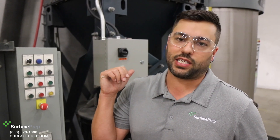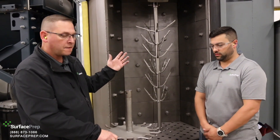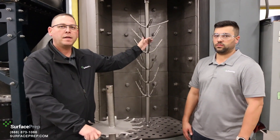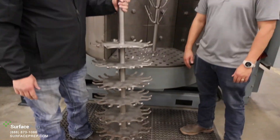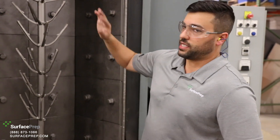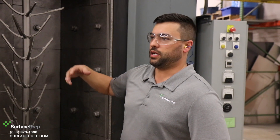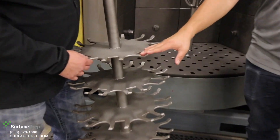This is another piece of wheel equipment — it's a spinner hanger. It's a very versatile piece of equipment. We can use these fixtures to hang just about any type of part you can imagine, and you can build any type of fixture you want. We've got two chambers here, it's a production-style machine, and it's easy to switch these fixtures out. When customer parts come in, we have a fixture made specifically for those, swap the tree out, put the new one in, and start running parts.